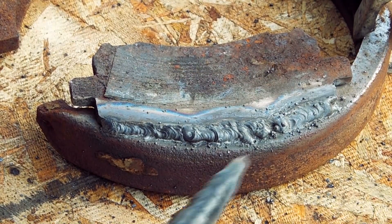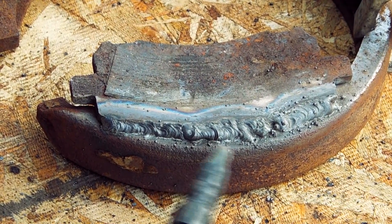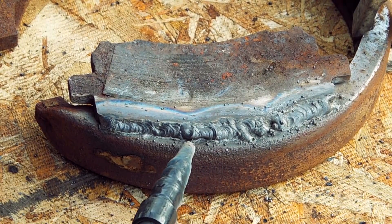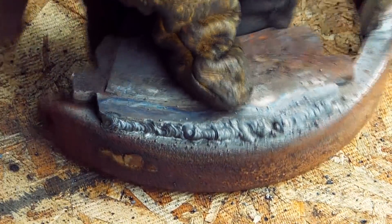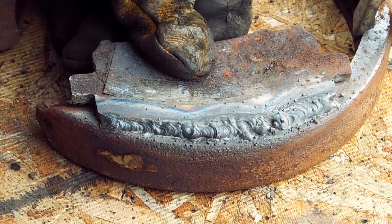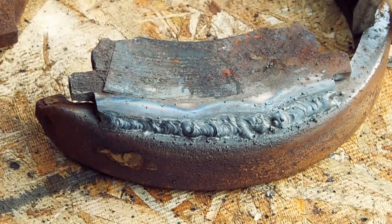Here's the same piece. Now I filled this in with wire feed speed number six, and it looks like it did a really good job from here on across, filling in what I missed before. I welcome your comments — what do you think? Is that a strong-looking weld? Would that hold? It might not be pretty, but would it be a structurally solid weld to hold these two pieces together? And as you can see, it's still hot.